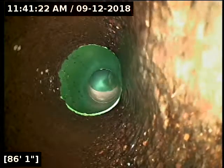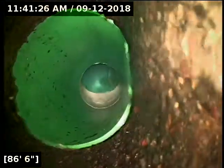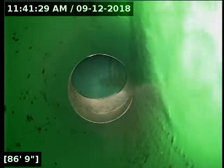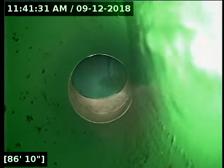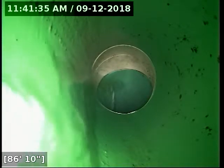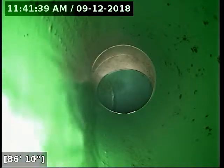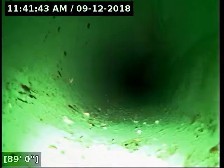Well, we'll see how it drains out. If we don't have any standing water left over, you might have the option of doing a pipe liner, epoxy liner, which doesn't require any digging. However, if you have bellies in the line still, you're going to retain whatever standing water is currently there. The transition here at 86 feet is over to 4-inch 3034 PVC pipe. This is probably where the city has done their update, out in the street, more than likely anyway.